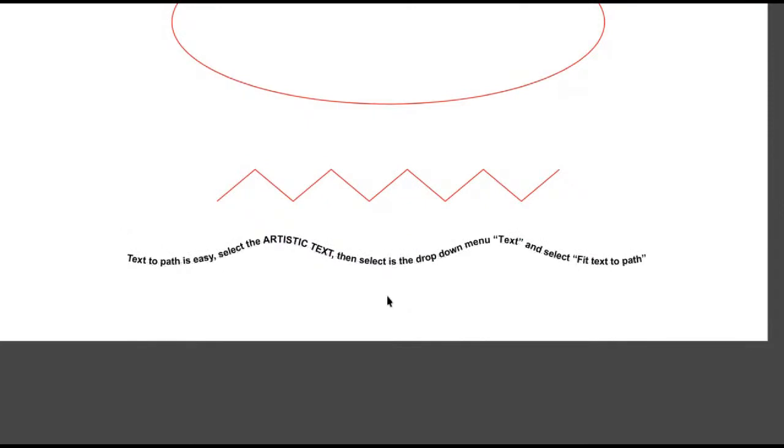But the nice thing is if I click the text tool and go back in there and type on it, it's going to type on that text and it's going to follow that little outline around it. Once you do break it apart, it doesn't know what that outline is, and so it's not going to really follow that outline. So if you do want to go back and retype the text, make sure it's still combined with the original line segment that you ran, and then it will continue to follow that path as you're processing it. And then of course you can engrave it, you can cut it, you can mark it, you can print it, and you can do whatever you want with the file at that point.